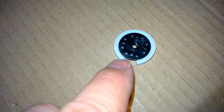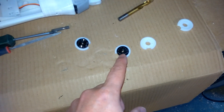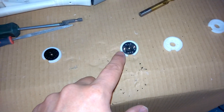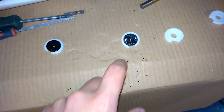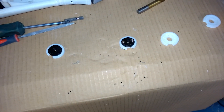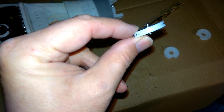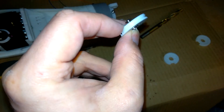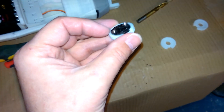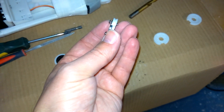I'm drilling out the holes we're going to use with a 2mm drill bit. I drilled out the center hole at 9.5mm and then with the servo pulley in place I drilled out all the holes we're using at 2mm. I'm then fitting two screws - using the screws that came with the servo. They've got a large flange on the top which will be handy for wrapping cables around later on. I'm putting the screws in so they're not fully tightened - they stick out a little bit out the other side - then I file off the piece that's protruding so that we've got it flat.